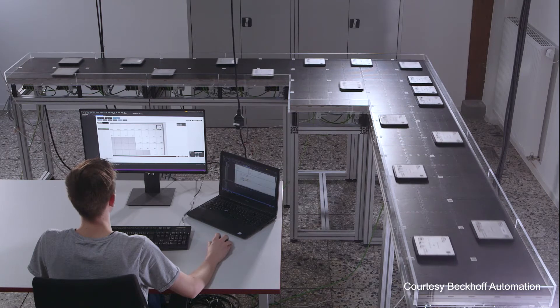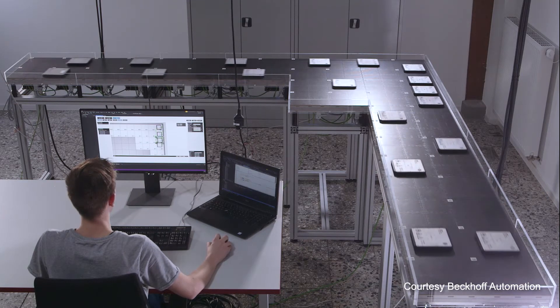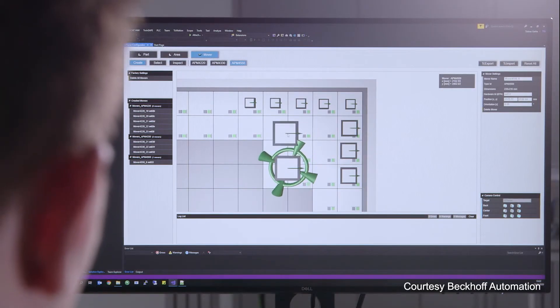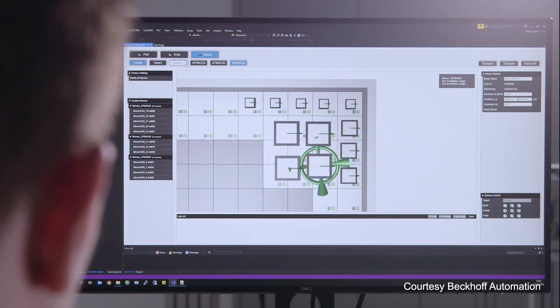Can you explain what makes this offering so new and innovative? Being able to freely move with six axes of freedom gives you the ability to start with a clean sheet of paper and redesign how you do things. You can position the mover in the proper orientation — so instead of needing a six-axis robot, maybe you only need a three-axis robot and your tooling becomes simpler. You're no longer confined to linear or rotary motion between stations. You have free 2D movement, so you can create buffers and optimal part flow through your processes.